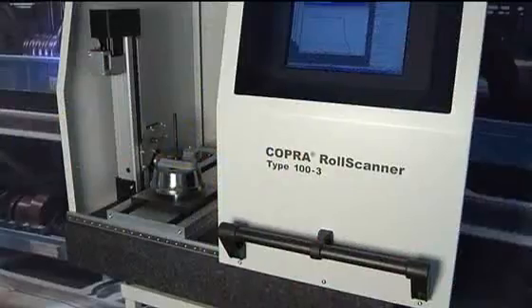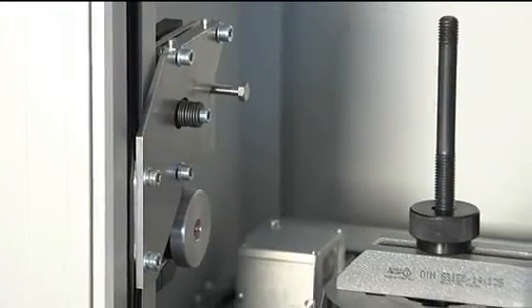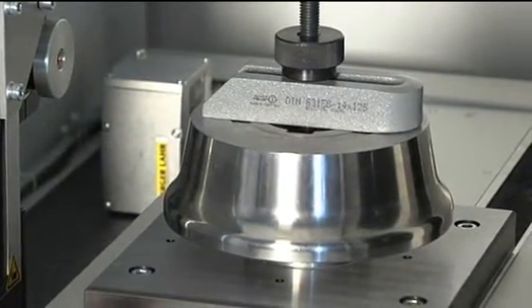To do that, you will always need a roll scanner. The reason is simple: even if you have paper drawings or CAD drawings, they will not help you. Usually during the setup of a machine, the rolls are returned, changed, and modified — and very often the data are not updated in the CAD drawing. So the data we have on paper or as a CAD drawing do not match with reality. You will have to scan the roll in any case. In addition, you need to put the roll into the recycling database from which you want to retrieve all that information.